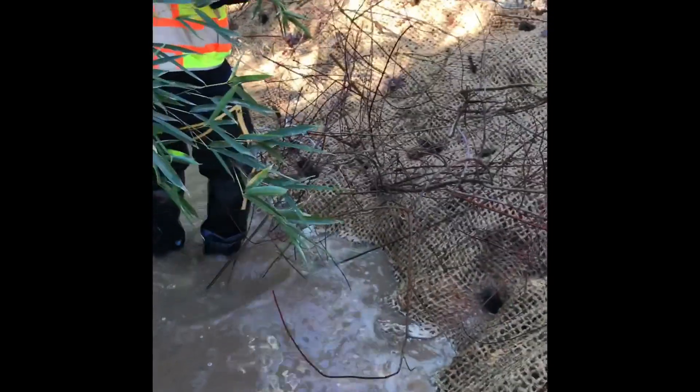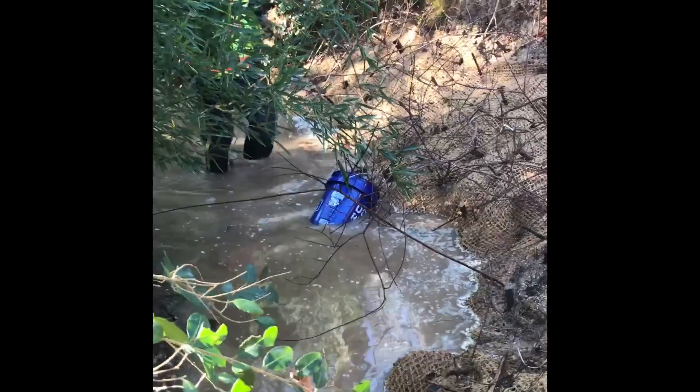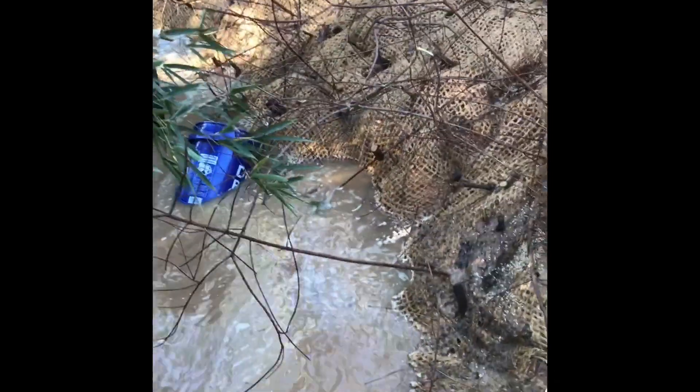We just need to have the right conditions — moisture will help. These will root, and our idea is to form a thicket here at the toe of the slope and hold this back at least temporarily until we can get maybe an engineered fix here one day if possible. But if not, maybe this will fix it. We've been at it about two hours, and you can see we have our fascine bundles here at the top. We didn't even unwrap them. We have them down in the mud along with our live stakes, all incorporated between the holes and the coir matting. Got it really loaded up — probably four fascine bundles and about 200 to 300 live stakes on this 25-foot section of bank at the base.